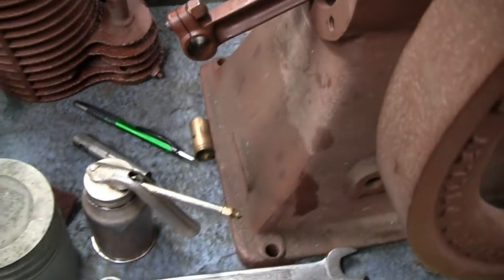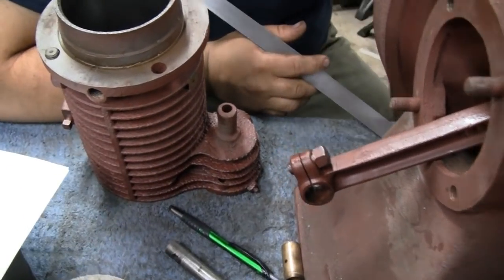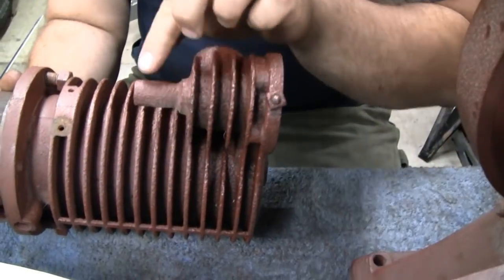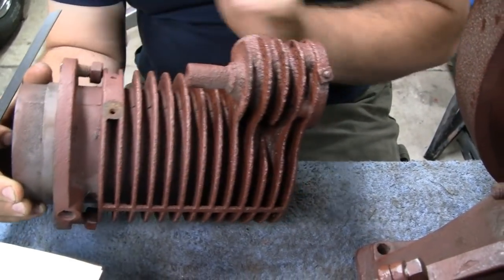But then we're discussing it and looking at this engine, and it has 2 valves, right? It's supposed to, but one of them is atmospheric. Right, the intake's atmospheric, and this here is the guide for the exhaust. The exhaust valve would then stick out this hole right here.